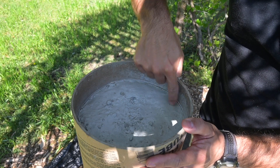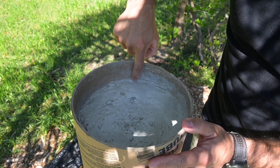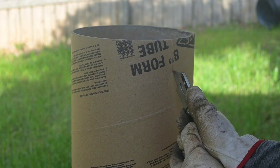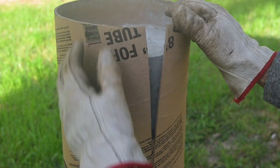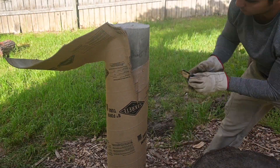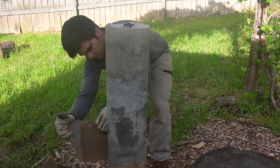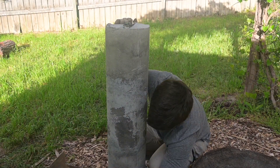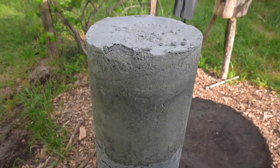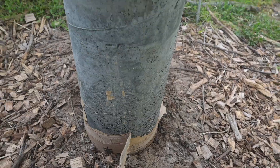You can see that there's a light gray color on the concrete — that's a pretty good indication that this upper layer is fully dry and hardened. It's also peeling away from the edge of the tube form, which is another indication that the tube form itself is ready to come off. Overall, I would say the condition of this pier looks pretty solid. Sure, there are a couple of places where the concrete's not perfectly smooth and it didn't completely adhere to the tube form, but otherwise it seems pretty well mixed. There aren't any dry pockets that immediately stand out. There's a little bit of surface cosmetic defects at the top, but I think that's more my fault from applying too much water at the top layer.